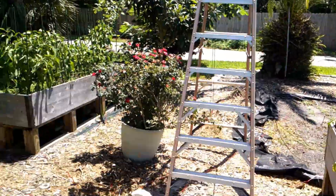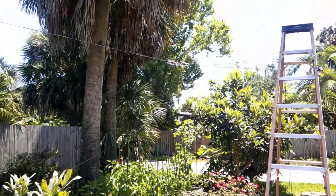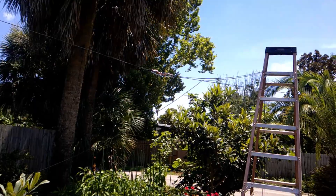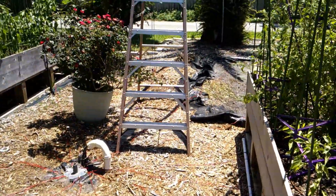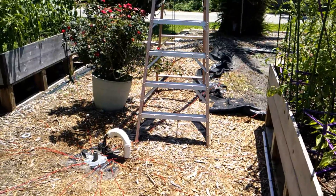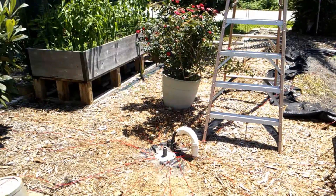This is where the antenna is going to go up tomorrow, hopefully. I've got one of the guy wire systems right there. The other one is hooked up, done with Pythagoras's theorem. If he's correct, I should end up with some wires up there at the 10-meter mark or so — not tight, but loose enough to keep it from being able to fall over. I can adjust them when they're up there.